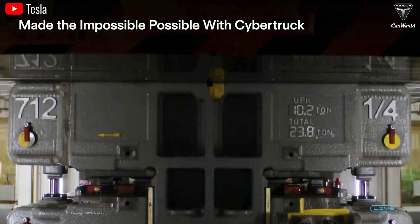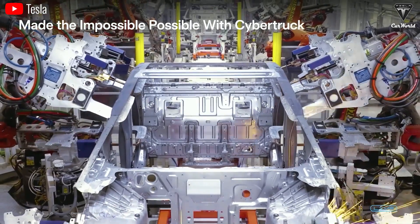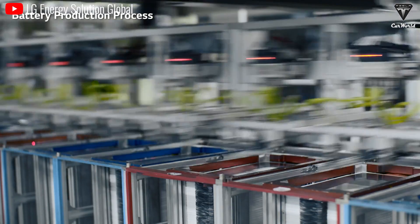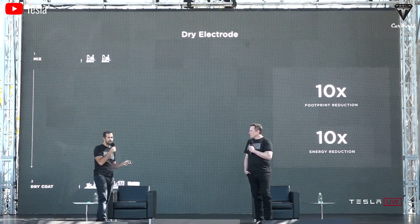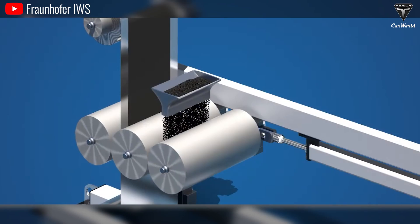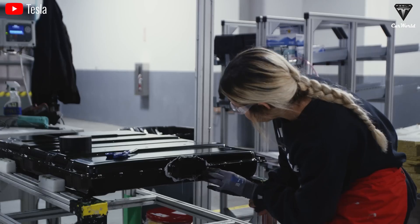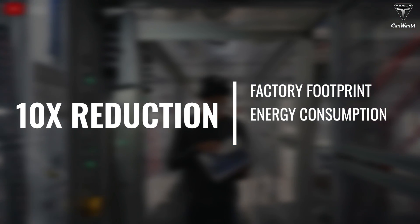The electrodes are then dried in very large ovens that are tens of meters long, increasing plant area, energy consumption, and processing time — making them pretty expensive in tons of different ways. We also need to note that the 4680s Tesla's currently using in the Cybertruck are a hybrid type: the anode is dry coated, but the cathode is not, resulting in the cathode accounting for over 35% of the total cell cost. Tesla still buys from suppliers like LG, where they're coated using the traditional wet process. With dry coating, the mixing process is no longer necessary, nor is the substantial energy consumption of the expensive ovens. Using a dry electrode coating process means going directly from powder to film, removing the entire step of adding and removing solvents — allowing Tesla to achieve a 10 times reduction in factory footprint and a 10 times reduction in energy consumption.